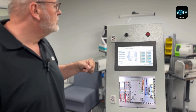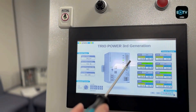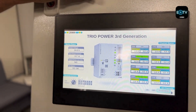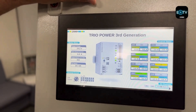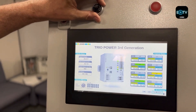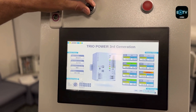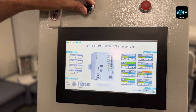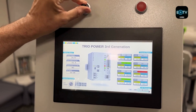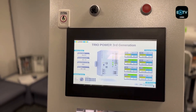As you can see, the overall voltage is 24 volts. If you focus in on a particular channel, like channel 6, it's currently set for 0.6 amps — it's green, so healthy. Take it up to 0.8 amps and it goes amber, basically telling us it's 80% loaded. If I then take it higher, it'll start to flash and eventually trip red, and once I clear that fault and turn it down, we can reset it and it's healthy again.